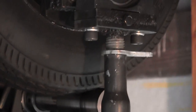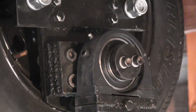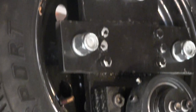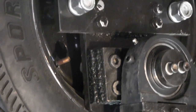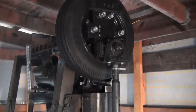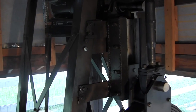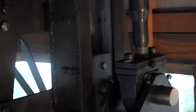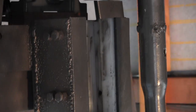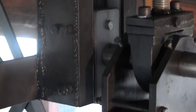You can see the connection is simply a pillow block on an inch-and-a-half bar that goes up to the pitman arm. Then it goes up to another pillow block that's attached to a cobbled-together attachment to the tire arm. I had a lot of half-inch steel around so I cut it up, welded it up, and bolted everything together.